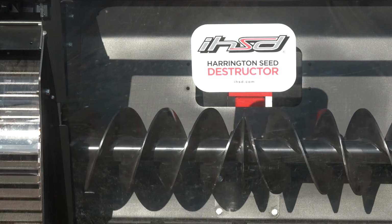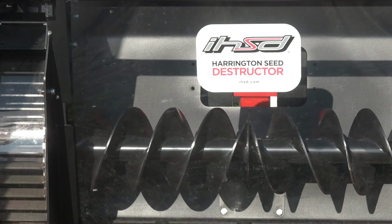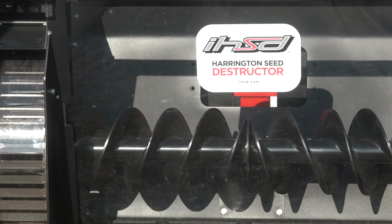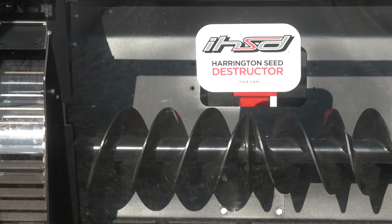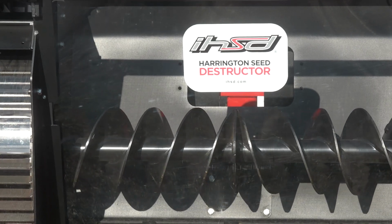Okay. How does this work? It goes on the back of a combine and really processes the outflow. Yeah. So this machine fits onto the back of the combine harvester just below the grain sieves. And so we take all of the chaff material from those sieves and we dump it all into this hopper. We then distribute the chaff into the mills at each end here that you can see.